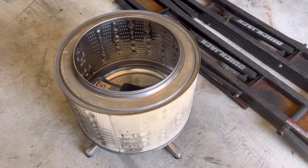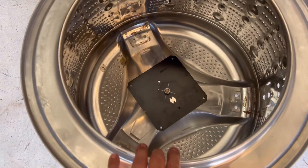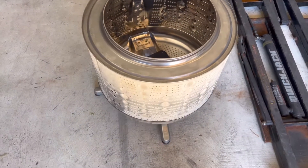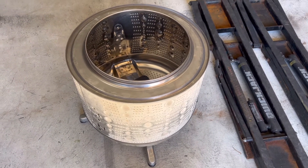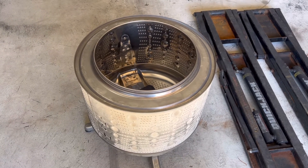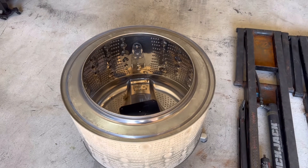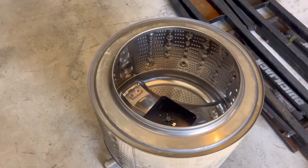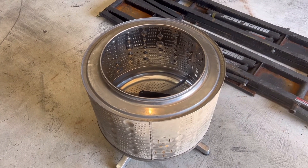We're back on this fire pit. What I'm noticing is no matter how much I tighten it, it stays pretty loose. So I'm going to take it apart and put a spacer — a piece of two-inch square pipe — in between the bottom base and the table legs, weld that in, and that should tighten everything up.